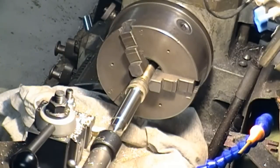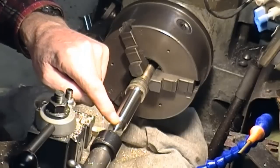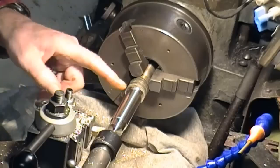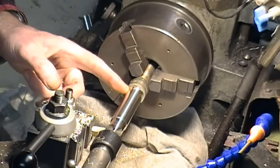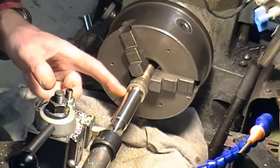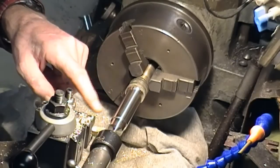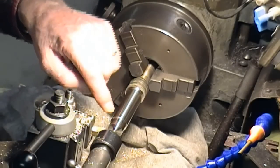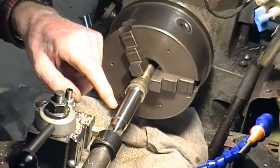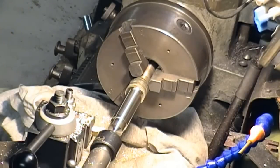This is one of those jobs where you sort of decide things as you go along. I think maybe I will keep that smaller diameter now I've got rid of the thread. I'll probably take it out of here - I might part it off or just use the bandsaw, cut that off, face it, and turn it down to match that end. That will allow for a small amount of displacement with use, and it might look prettier anyway.